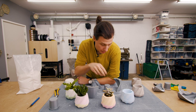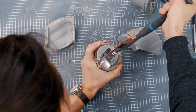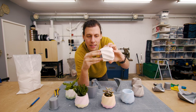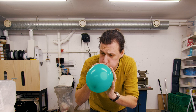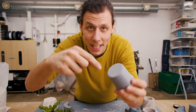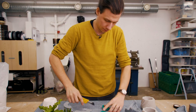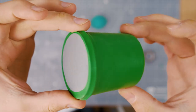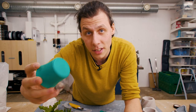The only thing I've really struggled with is getting the center core out from the inside. Even though it has a fairly steep angle which should allow it to easily come out, the ridges of the 3D printing sometimes tend to grab a little bit tight. I've tried sanding, tape, and a bunch of other things, but the by far easiest solution is just to take a balloon, snip off the end, and wrap it around the outside. This creates a super thin and slippery layer between the concrete and the mold, and once it's all hardened, the core slips right out.